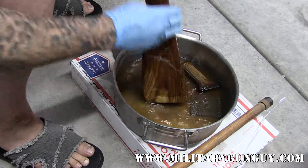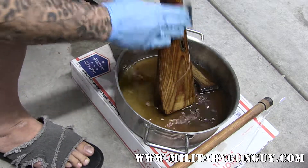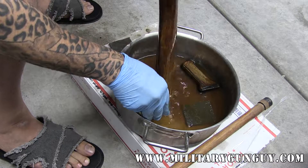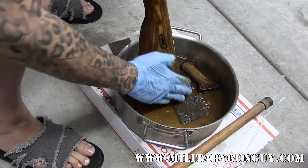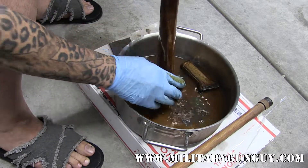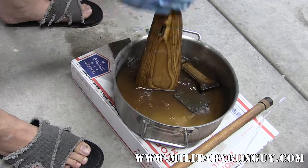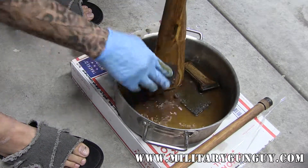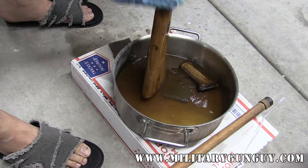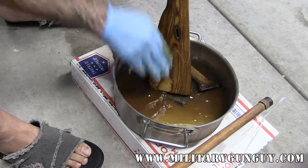Then I'll show you what the stock looks like afterwards, and we can plan on doing a refinish. This one's actually going to need to be cut into — to bring the sniper aspect back, we have to inlet the left side of the receiver for the scope mount. I'll show you how to do that along with locating the original holes on the sniper, drilling and tapping them, making sure the sight base is aligned properly, and bringing this thing back to its former original glory.